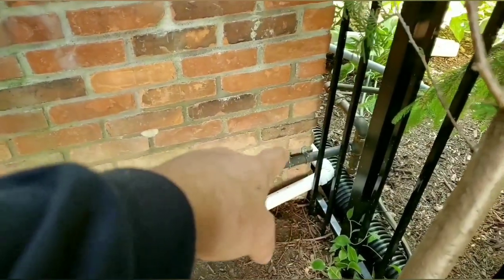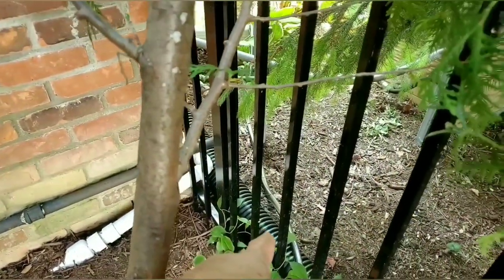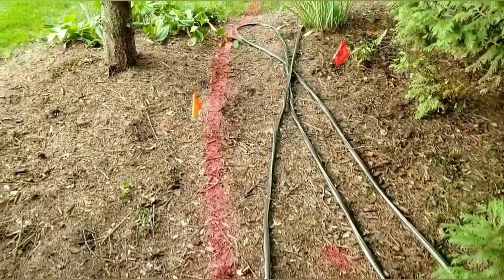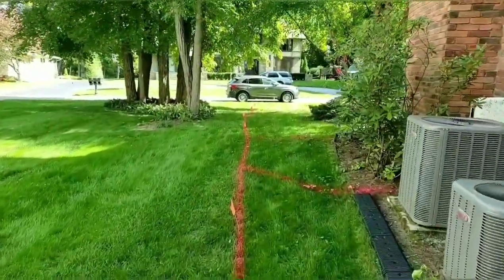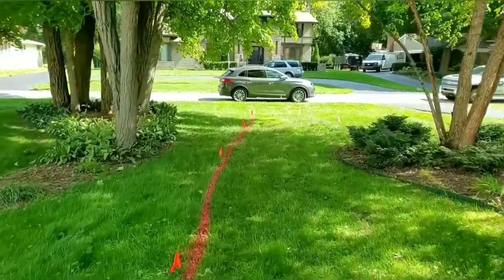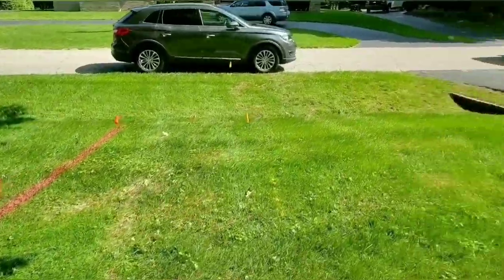So there's another sump pump that comes from the backyard. We gotta connect this to a 4-inch. We'll start our 4-inch here, and we'll start our 6-inch for gutters here, because we're gonna pick up this one in the backyard. I'll walk in the backyard and show you what this looks like. You got 120 feet of schedule 40 4-inch that you need, and then might as well just bring 120 feet of the 6-inch yellow pipe for all the downspouts.